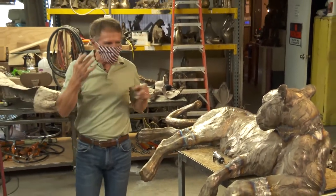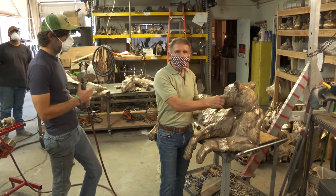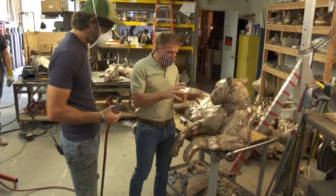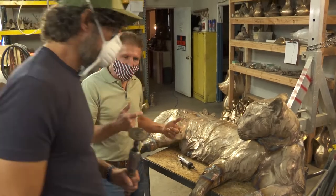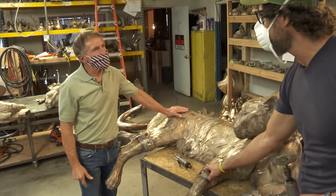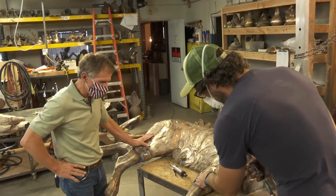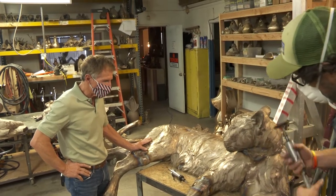As an artist, I put all this time and work into this piece, only to watch it be cut up into sections. And then you work really hard with the textures, only to see a great big weld going through my texture. Now — is it called chasing? Yep. So you'll chase, which is grinding the welds to match my texture. The reason it's called chasing is that here you have a problem where the weld has been made, and you're kind of chasing that problem away. We want to keep our texturing within a half inch or so of what you've done, and we have to make it look like this was never done.